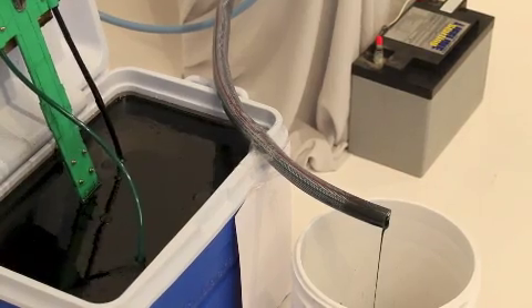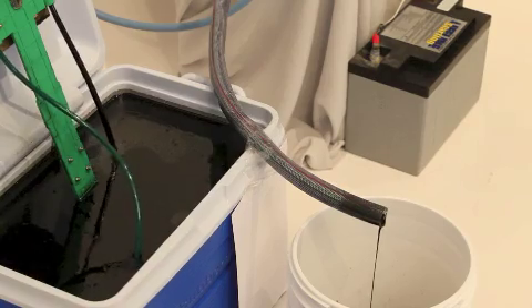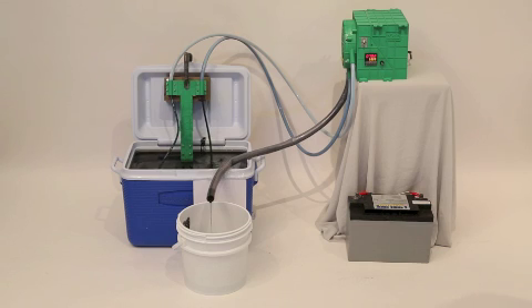So now you can see five minutes in, still a huge amount of oil going up that right-hand pipe and the same amount of oil coming down into the bucket and filling it. You can just see in front of us on the left-hand side the water starting to clear. In fact you can just see the water starting to clear in the bottom right-hand corner there now. So we're getting down to the main bulk of the oil coming off the top of the surface. Very shortly you'll see the water completely starting to clear in areas — and then you get a really good view of how efficient these tubes are. At the seven-minute mark you can see how efficient the tubes are at getting the last of the oil off the surface.